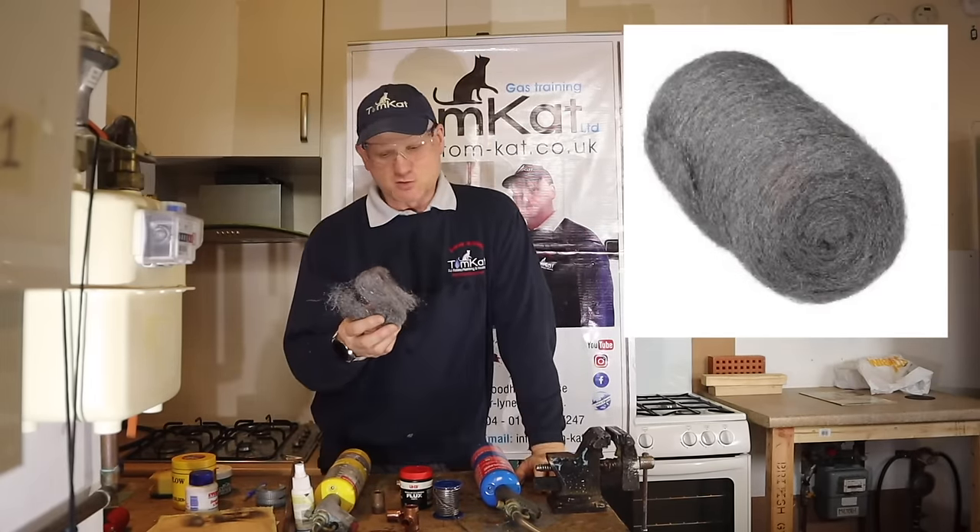Let's get that pressure tested. I've got it all rigged up. To do the pressure test, we need to pressurize it to one and a half times working pressure for an hour. On site, there are also two other tests you should do with plastic pipe. I'm going to put three bar in for now and see if our soldered joints are okay. One thing you can't do is solder a fitting while there's water in your pipe — the water takes all the heat out, which stops the solder reaching melting point and being drawn in by capillary attraction.